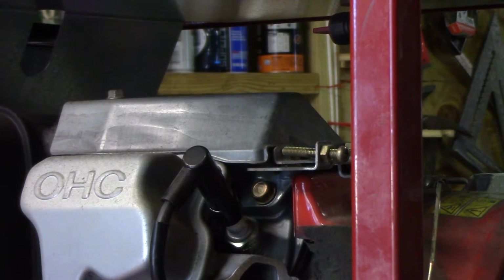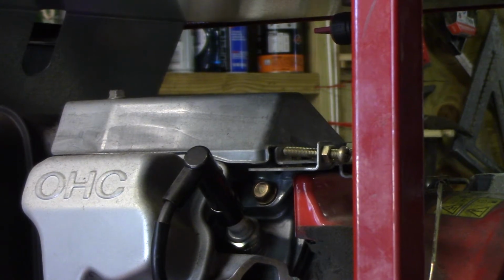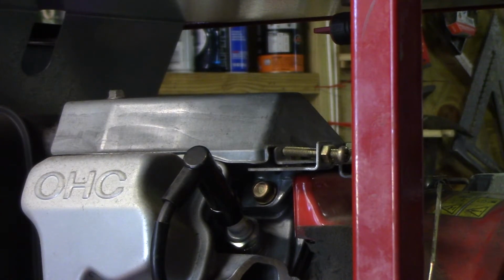The model number on this PM, that's a generator, not the engine. The generator is PM0435000. Current on it says 41.6/20.8. Now hertz is 60, that's normal. RPM is supposed to be 3,600 RPMs. I didn't see that before, so that tells me a lot.